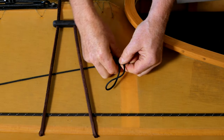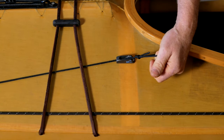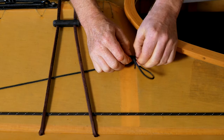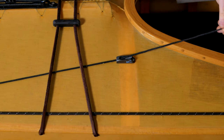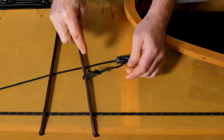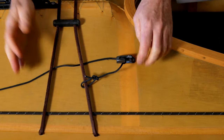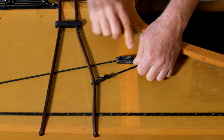The bowline is a little loop knot you can easily tie and untie — look it up on the internet. It gives you something to grab in an emergency and makes sure the line won't accidentally slip forward through the fair lead. If you're going with an open style cleat, I'd recommend cutting this a little longer — about 18 inches — and tying it around the deck line using that same bowline knot. With an open cleat, when the line is out of the cleat there's nothing to stop it from coming loose. To raise the sail, grab the loop and pull it back, then set the line down into the open cleat.